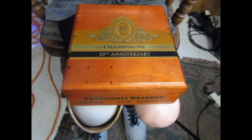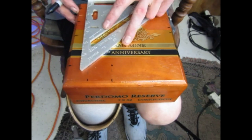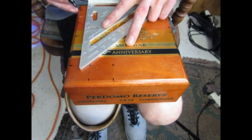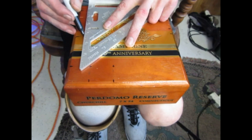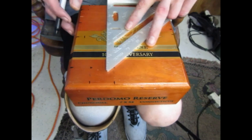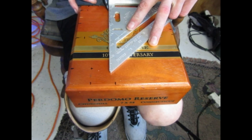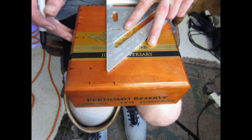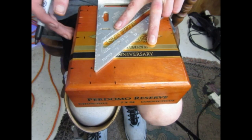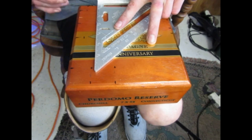One thing that people tend to overlook is the depth of the buttons. If you're going with LED buttons, they tend to be pretty deep — about two and a half inches. If they're Sanwa or Suzo Hap buttons, that's about what they'll be, and those are the kind of builds that I would recommend. The Japanese hardware is better than the Chinese knockoffs.